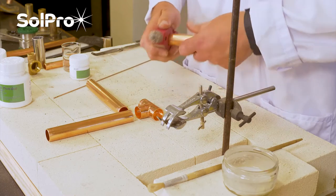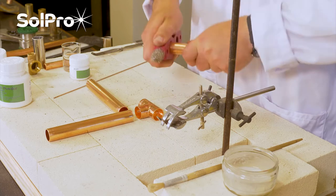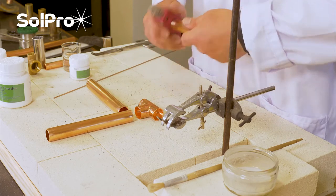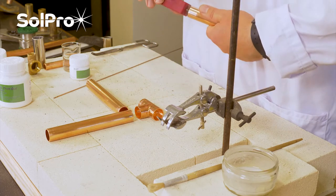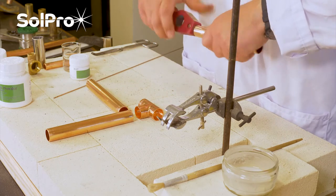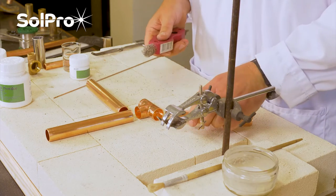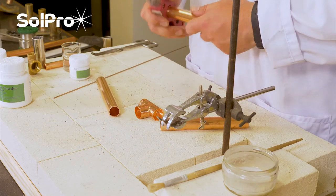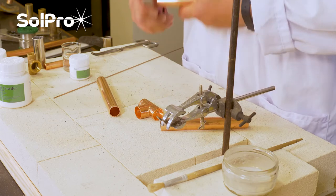This is a 22mm copper pipe. You can join these together with a soft solder alloy, which in a domestic environment will be absolutely no problem. But in a commercial environment - for heat exchangers, air conditioning, the cooling industry - the soft solder is not strong enough and robust enough to put up with the rigors of everyday use.